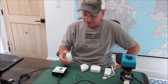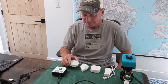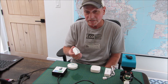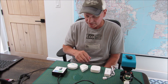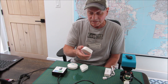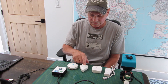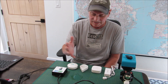Some of the different technologies. Most of the leak sensors, at least the puck-style leak sensors, are battery powered. There are different communication technologies and some are better for batteries than others. There are Z-Wave and ZigBee type leak sensors — the batteries are typically good for one to two years, and that's not bad. And then this is a LoRa type leak sensor; the batteries in this are good for three to five years. These sensors also have a much longer distance, although ZigBee and Z-Wave can compensate with their mesh networking technology to get longer distances.